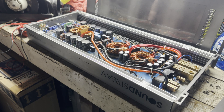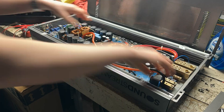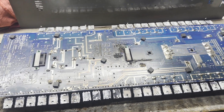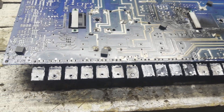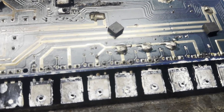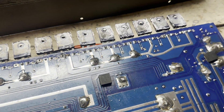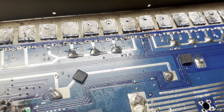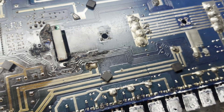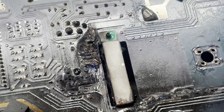Next I will take the board out of the case. You can see the case with burn marks where the FETs and inductor blew, in the middle of the board. The contacts of the output section and rectifier FETs are alright, but quite a few of the contacts for the power supply FETs are charred. The output side looks fine, but right here you can see where the majority of the damage is — PCB damage and traces that will need to be repaired.